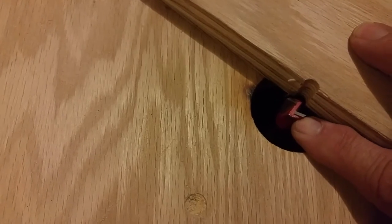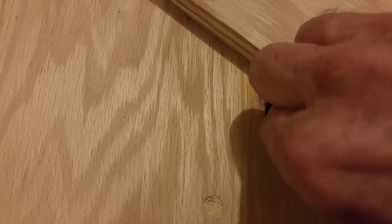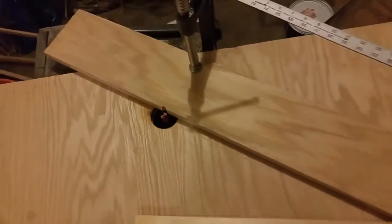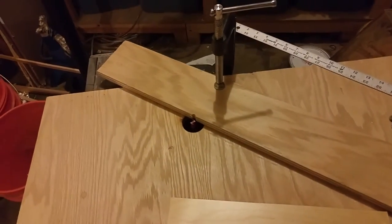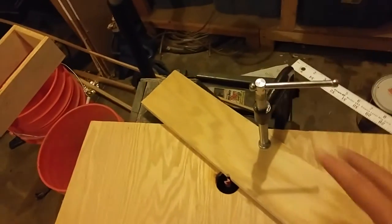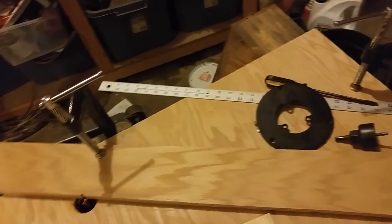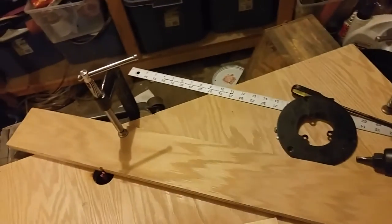You can see that nice bit. See how the blade has got a sharp edge? That sharp edge is swinging towards the fence, so that fence has to be on that side of the bit. In case you get a little mirrored reverse when you're assembling, make sure the fence is on the right side. I can simply remove the clamp and lift it over and put it on the other side, but this is the proper setup.